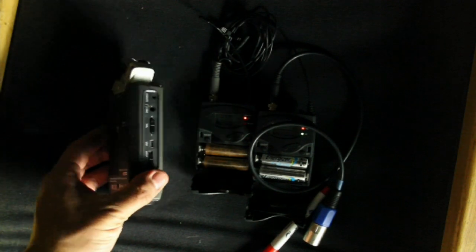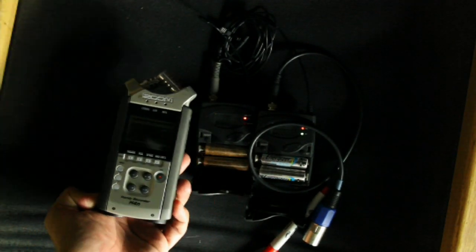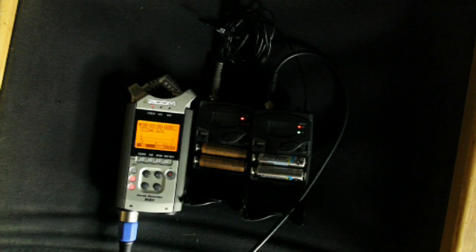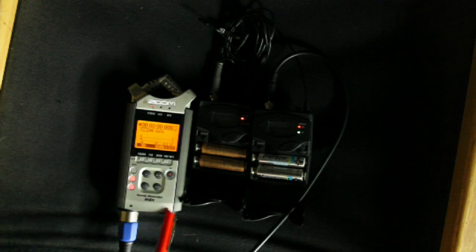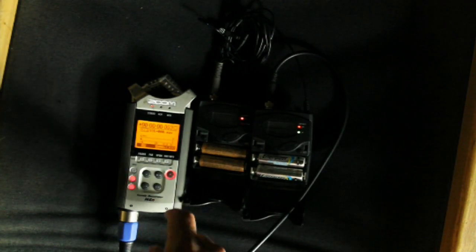This here is the Zoom recorder. It might look a little intimidating with all the buttons, but you turn it to the side, the power button is at the very bottom and you slide it downward. It will start doing its menu spin-up. You can use the mic input or the channel 1-2 input — it's fine to just use the channel 1-2 input. Plug in your XLR, the three-prong cable that comes out of the receiver, into the Zoom. One annoying thing about the Zoom is you won't hear any audio until you press the record button once — but pressing it one time is not recording. Press it a second time, and once you see those numbers spinning, you're recording.